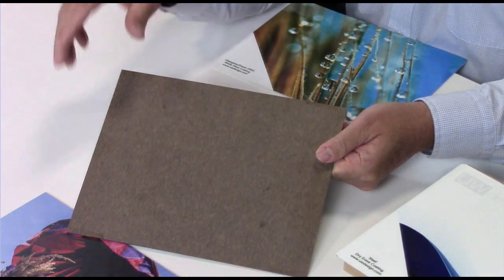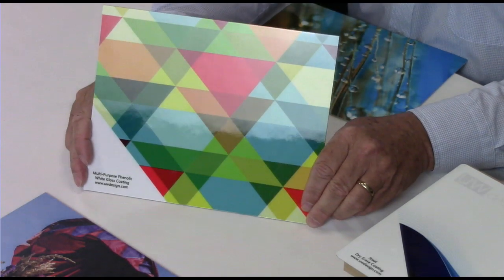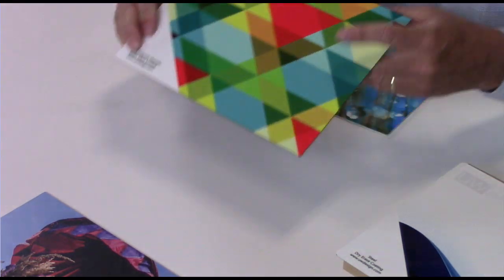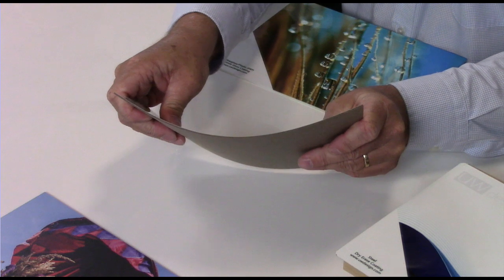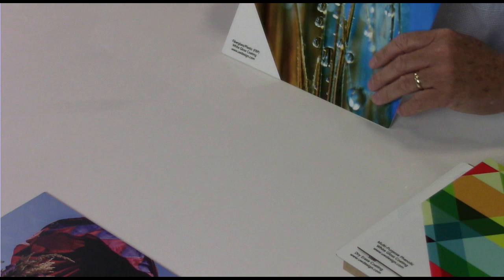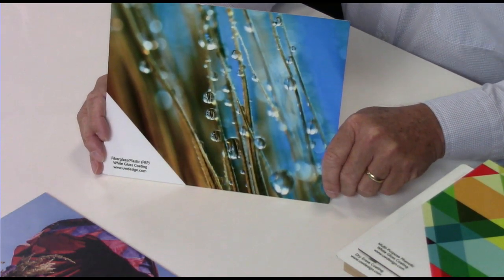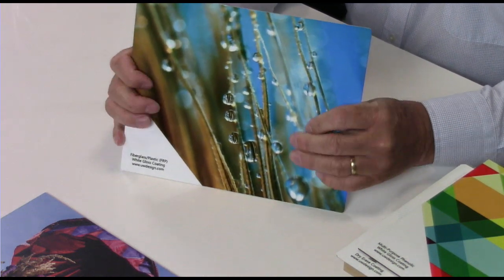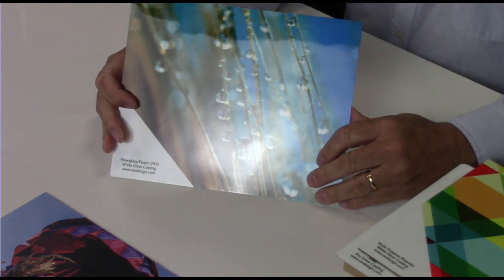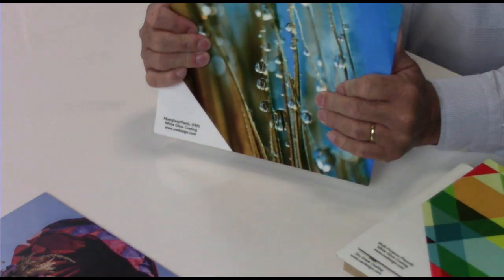This is a piece of phenolic. If you have cut-in tabletops or that sort of thing, that's what this material is made from. A lot of people like this because they're used to dealing with phenolic in their everyday life. And it's flexible as well. That's where the flexible coating comes in handy too, because if you're going to do something flexible like that, the last thing you need is cracking. And this is a piece of fiberglass reinforced plastic. It's got some flex to it, not a great deal, and you would use this where you want a really cheap substrate.